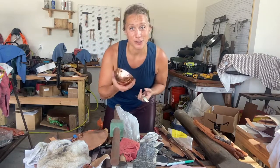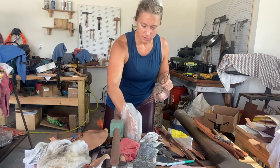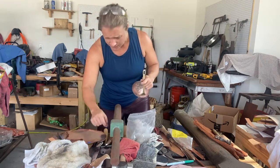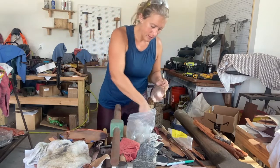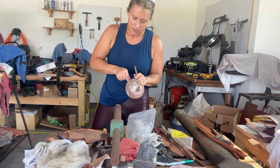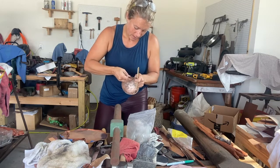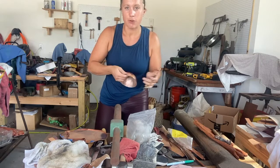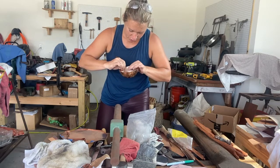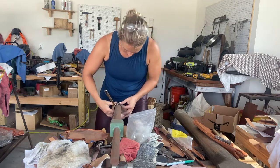It's clean, and I've also discovered it's lacquered — so that'll be fun. Everything is organized, so now I get to work my magic. When you drill out rivets, the metal gets moved and you have to kind of wiggle the hole you made so you can force the rivet through. Then once it's through, you get to smush the rivet back on.